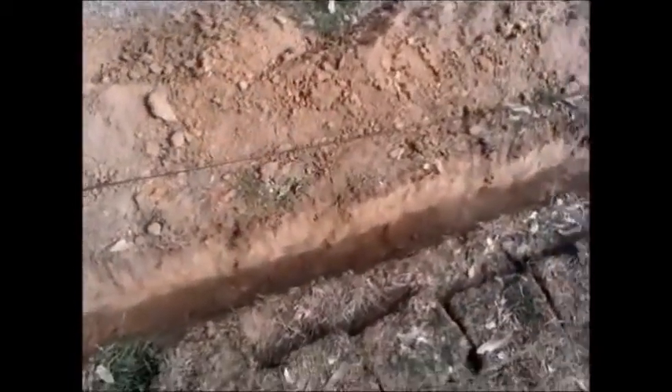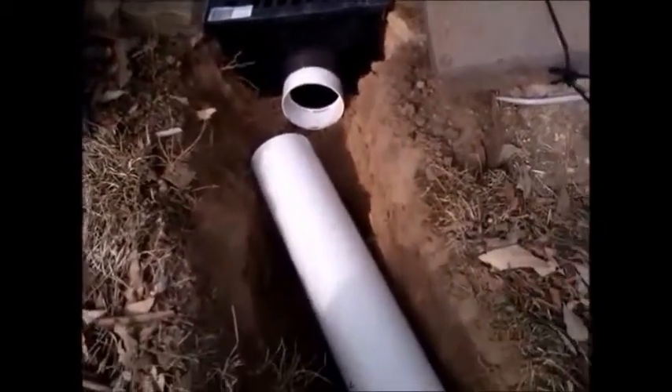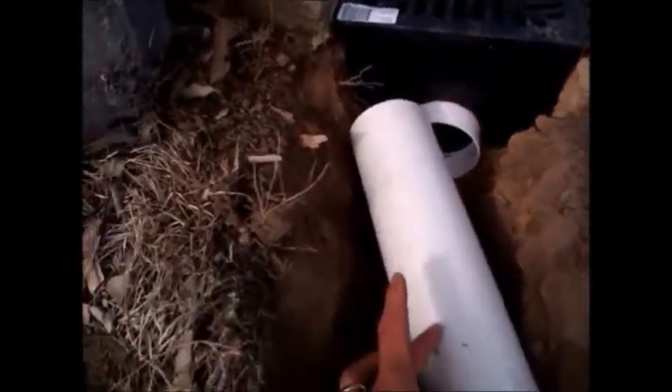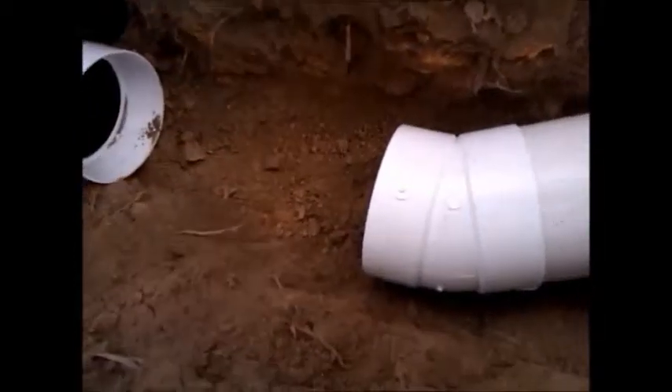Because it's only foot traffic in this area, there's no need to put the pipe in too deep, and it saves a lot of hard labor. Just testing to see whether it fits — at the moment it is not meeting the pit nicely. Looks like I'll need an elbow around here, and judging by this it should be around a 22 and a half degree elbow. Okay, elbow's done.